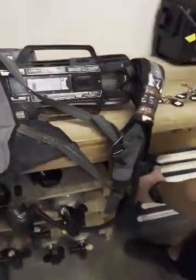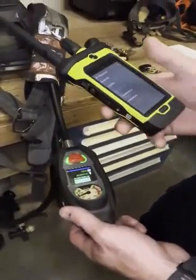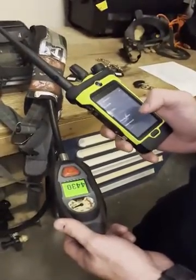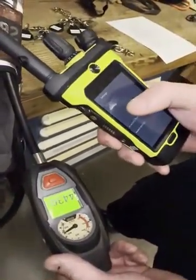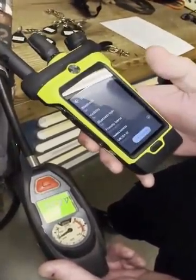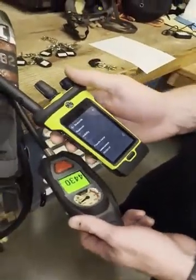Turn on the airpack and wait for it to boot up. Watch the radio screen for the accept pair prompt. Accept the pair. You'll hear the audible connect and then disconnect — that's the normal operation for the radio.